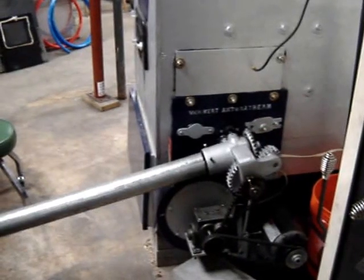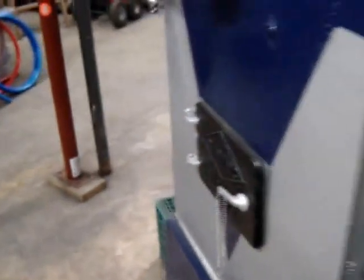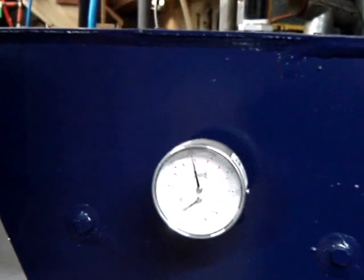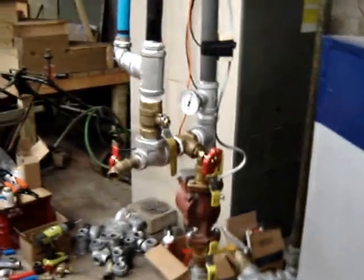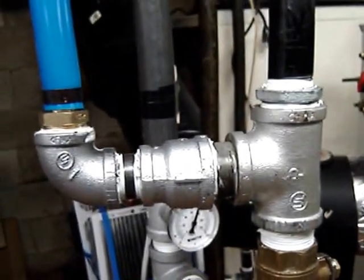It's still running, it's going to take a long time to recover now. Boiler temperature was down to about 120 degrees below, now it's putting out about 174. I don't know what's getting back on the return — the temperature gauge above the return, it's reading like 160. That's about right.